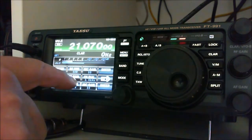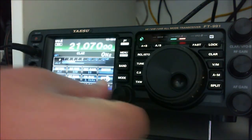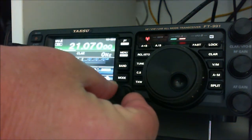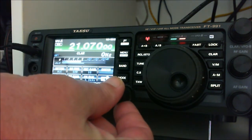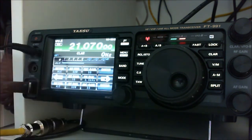If I want to put out a dirty signal, all I have to do is turn the DT gain up. If I do a transmit now — I won't do it for long — you'll see the ALC is through the roof. If I turn the digital gain down, I can get rid of the ALC completely off the screen.